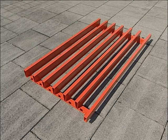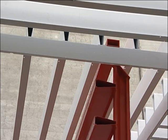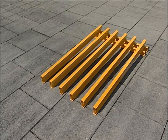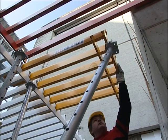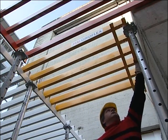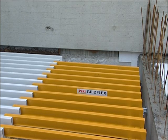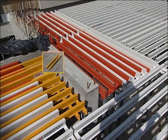The red elements are assembled for width compensation. Simply install in the frame of the standard element, swivel upwards, and set the props. The yellow elements, for length compensation, are mounted on the girder grid and supported on the wall side. Small filler areas, or the corner between width and length compensations, are filled with the 20 filler element.